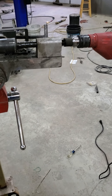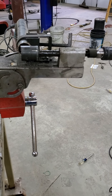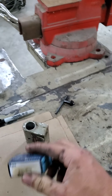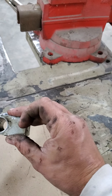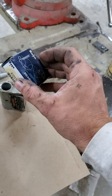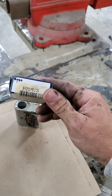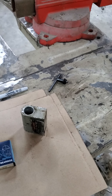If you have access to a mill, you could also cut the block and lower that center line. They usually don't need much — around 60 to 100 thousandths — to get them back on center. But if you don't want to buy one of those blocks and you've got your original block with worn out bushings, you knock the bushings out and replace with a bearing. You need to ream the block out for the bearing, probably on a mill or with a reamer, to get at least a solid tap fit. I think these bearings are like $15.